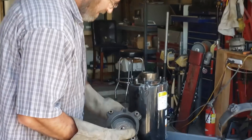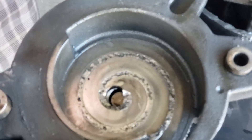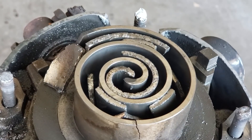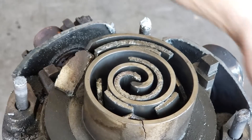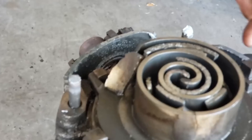Look at it — I didn't do this to it. The scroll pieces that are supposed to be on here — there's your failure. Using the plasma cutter to cut the compressor open, I had a hard time because I was using it broken. I didn't realize the tip was worn down inside there. Now it's cutting — see how those cuts look way better, like cutting through paper? The top part I was really fighting. Could be hot down there.